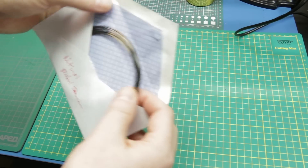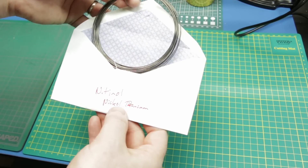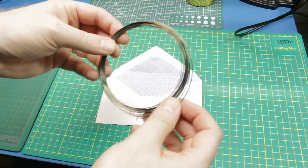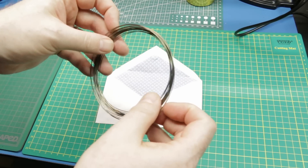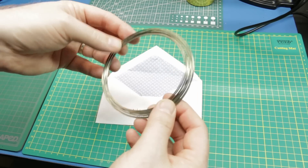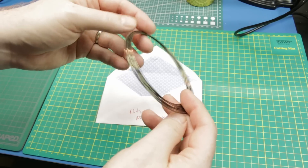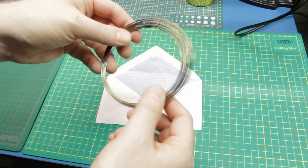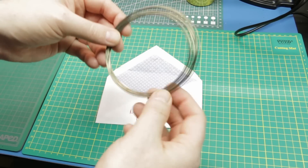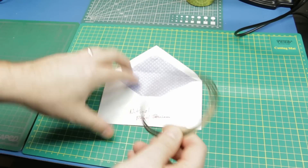This is an eBay find with very strange packaging. It's called Nitinol - a nickel titanium alloy. It's just a wire like piano wire, but when you apply heat or current through it, it will form back to a shape that you have made it learn. You can use this for muscle wire in robotics projects. I'm really looking forward to trying it for some rudimentary hand movements on the robotic arm - seems to make a lot more sense than servos.